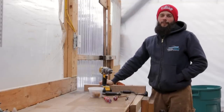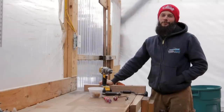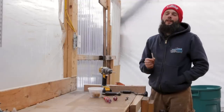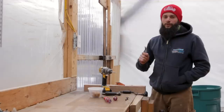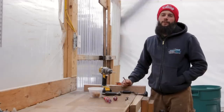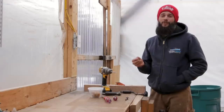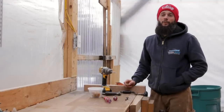There's a saying in woodworking: without scrap, it's crap. And this is one of those instances. So we're getting ready to screw in the frames with these big old bronze screws. And before we do that, we gotta do some test fits with the drill bit and with the screws and the screwdrivers and make sure that everything's gonna go smooth and hunky-dory in these oak timbers. Because if you snap one of these off or get it stuck halfway, oh man, it could be a nightmare. We really don't wanna do that.